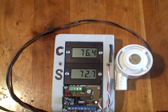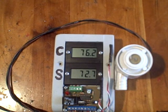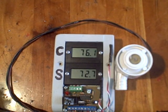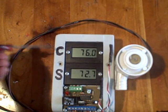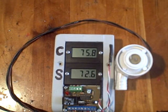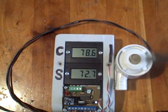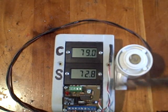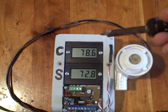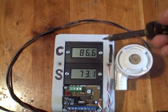The first thing we want to do is turn on our pump. The on time is already preset at about a differential of 20 degrees — in other words, the difference in temperature between the storage tank and the collector has to be about 20 degrees in order to turn the pump on, which is a nice setting. So we're going to turn it on and see at what temperature it comes off. The storage tank temperature is 72, so the pump should come on when the collector reaches 92 degrees, approximately. At about 93 degrees it came on.